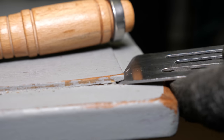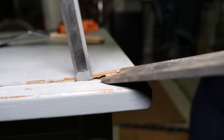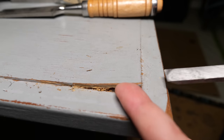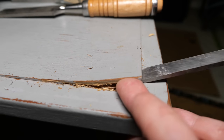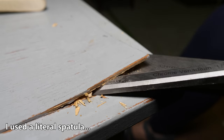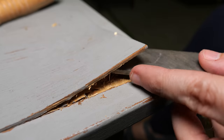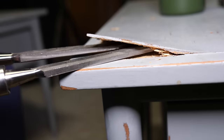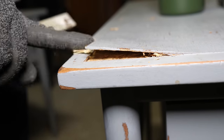To make this repair, I'm going to use a combination of chisels and a small spatula to pry the veneer away from the particle board as delicately as possible. You can see the lifted area that is damaged existed before the side table was painted and was subsequently painted over. It was a very tedious process prying away the veneer. The wide flat chisel was really good for skimming the surface between the veneer, and I used the spatula to help prop the veneer away so that I didn't accidentally gouge it.